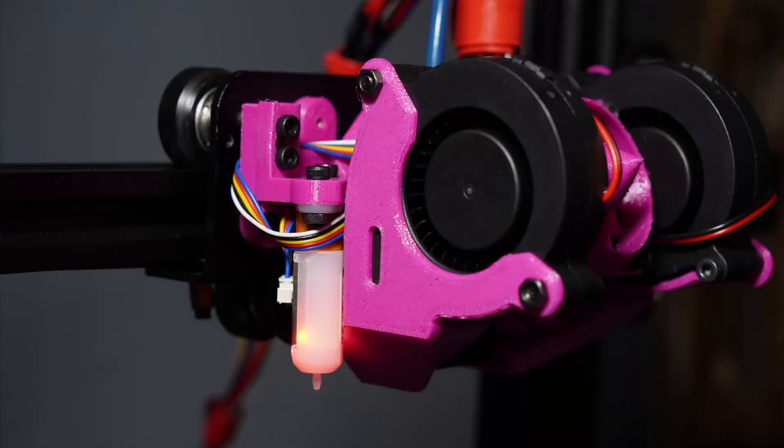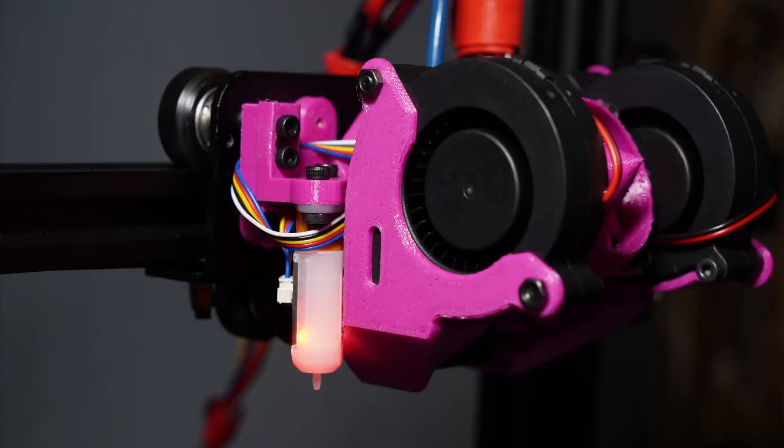With the BL Touch, this was also a challenge. I mounted it on the left side of the hot end — that's just where I had it before. But with this hot end, the Gen 7, the first few wings and mounts I printed interfered with the limiter switch on the x-axis. The first one actually snapped because when it went to home all the axes, it just went right into the switch and broke. So I had to figure out a combination of mounts and wings to make this work without interfering with that switch. As you can see, the clearance was pretty tight, but it ended up working. I had to wrap the wire around and do some interesting cable management, but it works.